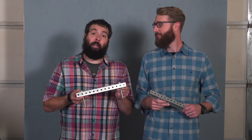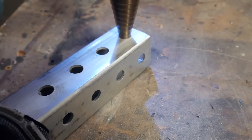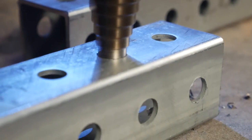Our brackets are made out of perforated metal tubing and we'll fasten them to the joists using lag bolts. The square tube is strong enough to support our shelves and makes it easy to secure our threaded rods. Cut your tubing to match the depth of your shelf. Drill the outside holes to 3/8 of an inch with a step bit to hold your threaded rod, and drill the second hole in from each end on both sides to fit your 3/8 lag bolts.